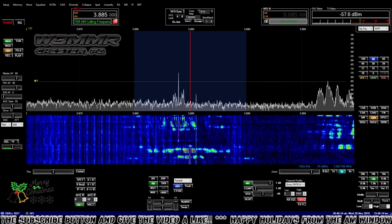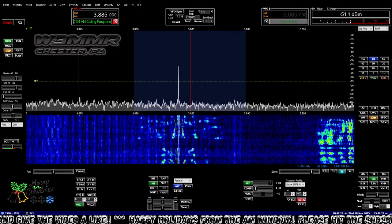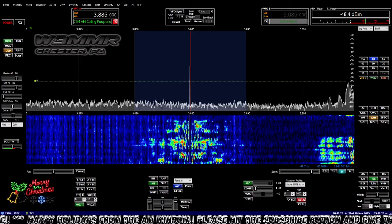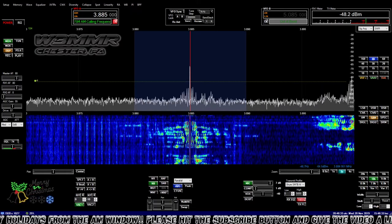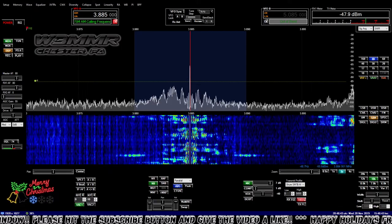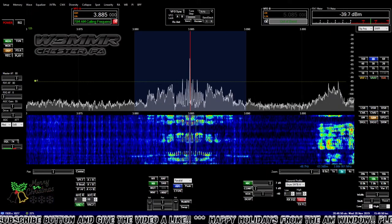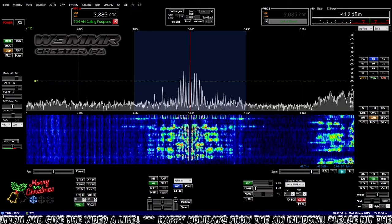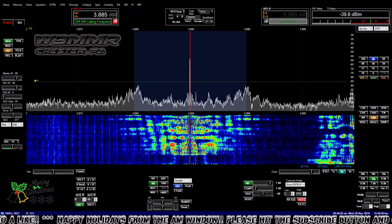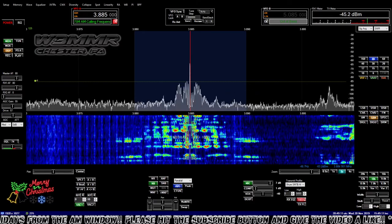What is the gain at 70 or 80 degrees — high-angle stuff? The 3 dB roll-off take-off angle — let me bring up the model real quick. I was playing with it last night trying to figure out some new information. Let me change the frequency — I've been tooling around with the model — for the design, 3.850, and there we go. Let me bring up the two-dimensional plot with the data and then I can move the azimuth. At 45 degrees, they measure it in dBi, so the maximum gain on that slice is 9.69 dBi, which I believe is equivalent to around 4 dB.